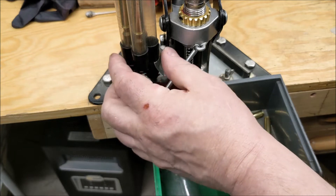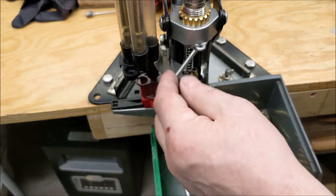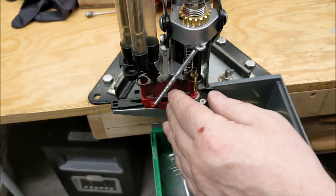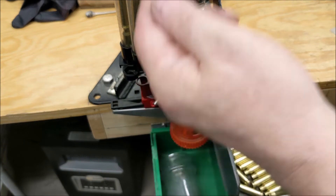For each case size you've got to adjust this to where it drops right. Where I had to adjust — that's where my clearance happened. It needed to be thick enough or else it would move, but it had to be thin enough where this cleared in the right spots, which is the first half going down.